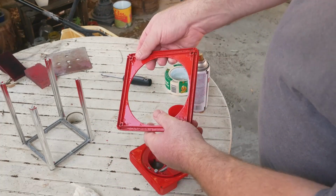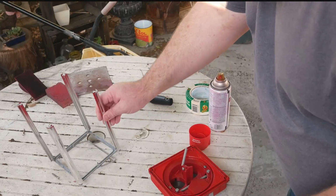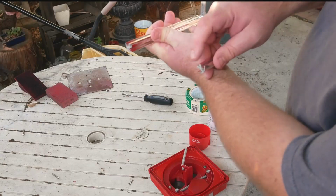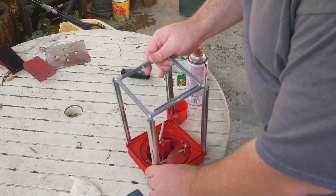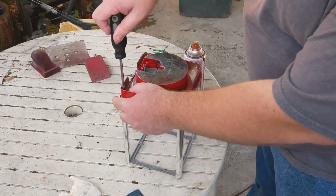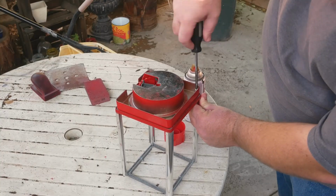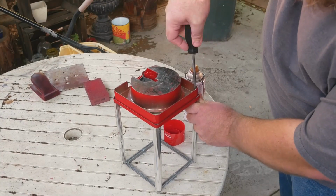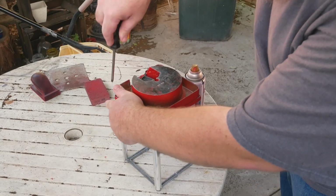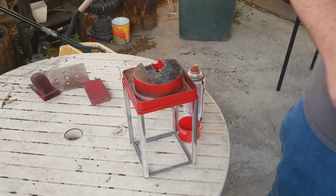There is one way that this goes, and these little prongs have to go up on this particular machine. Those prongs line up with these little spaces made from these extrusions. And yes, it can be a bit of a pain to line all this up at once. But again, the way I do it is I go in halves with each corner, just like so. And again, this is a habit from me being a mechanic, because that's what I did when I was 16. And again, don't reef on any of this. This is just regular old cast metal. It's not going to hold all that much anyway. And then install the other 2 screws.